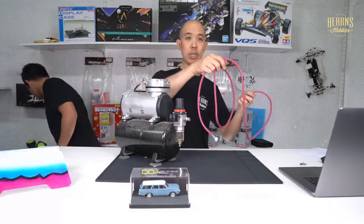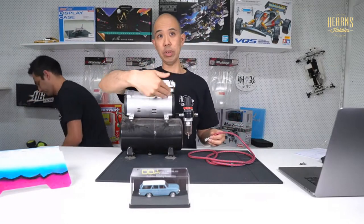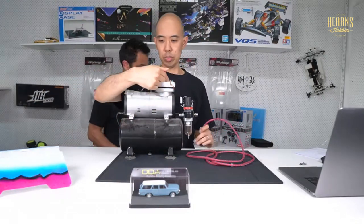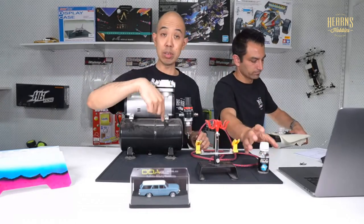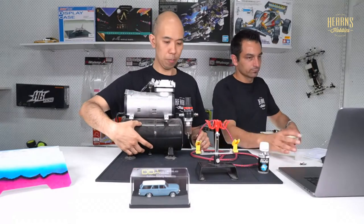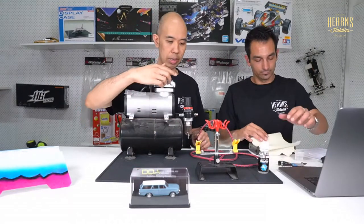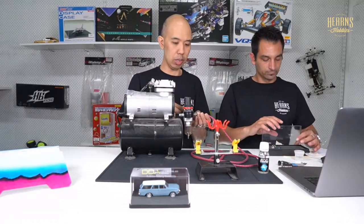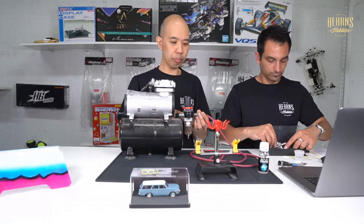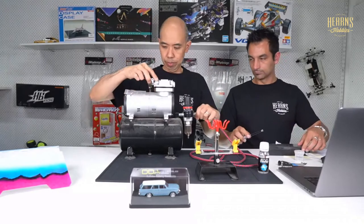So just as a quick explanation, this particular compressor is the tank type. On the top you've got the actual compressor motor, so it's going to be drawing air inside, and then it blows it into this tank here, which holds onto it. And then when this particular tank is up to pressure, this switches off, and then you draw off the air through this hose that I'm connecting up to your airbrush. So first thing I'm doing, I'm just screwing on the end of the hose.